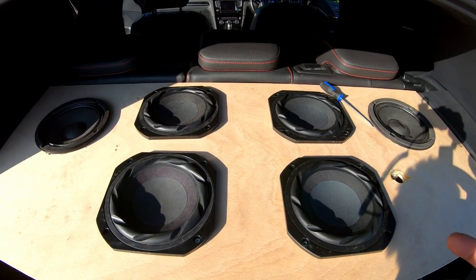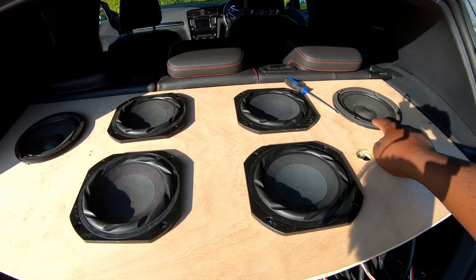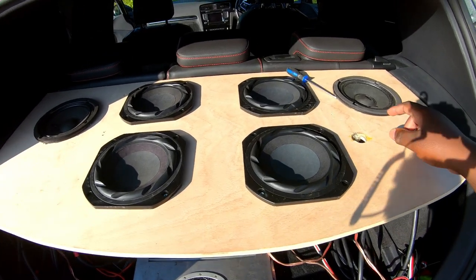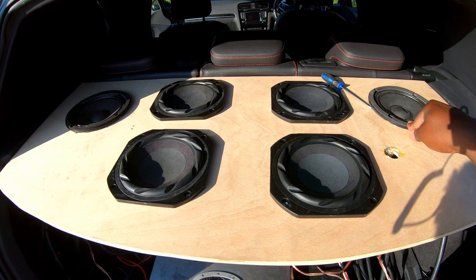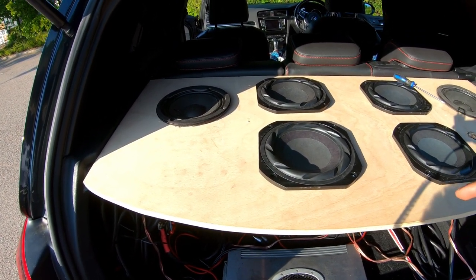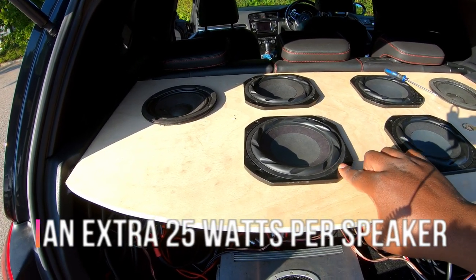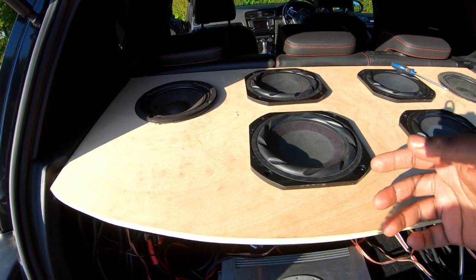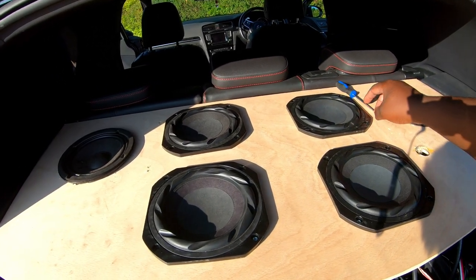It's going to be a bit hard because these are 4 ohms and 8 ohms, but if I put these on separate channels, they should be getting about 125 watts each at full blast. At the same sort of volume, bridged, it should be getting more wattage on these. So 2 versus 2, these are going to have slightly more wattage, but that's a byproduct of the ohmage they are. But it should give you a representation of which ones are louder.